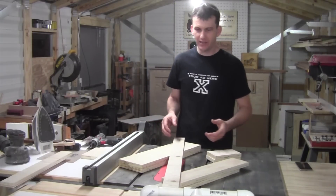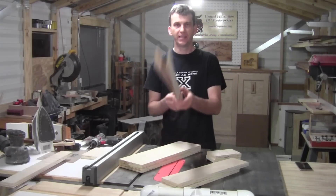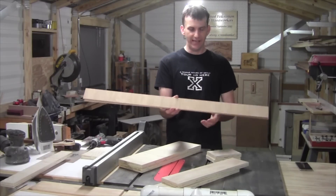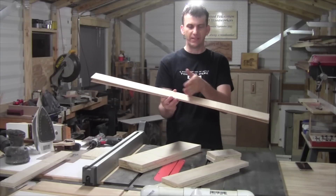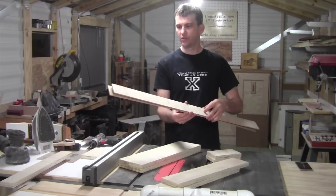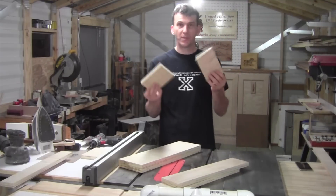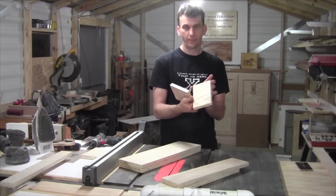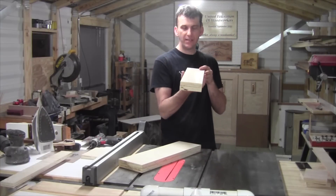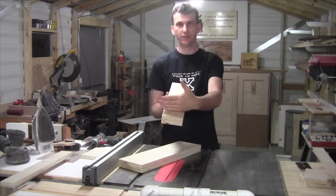Alright guys, as you can see I've got the parts cut here — some are rough dimensions right now, we're going to cut them down to final size in just a minute. I've got some quarter-inch plywood strips cut here, two and a half inches wide — these are going to be our base for the keys and such. I've got two pieces that are four inches wide and six inches long, and two pieces that are four inches wide and currently 18 inches long — we're going to be cutting those down to their final length and width.